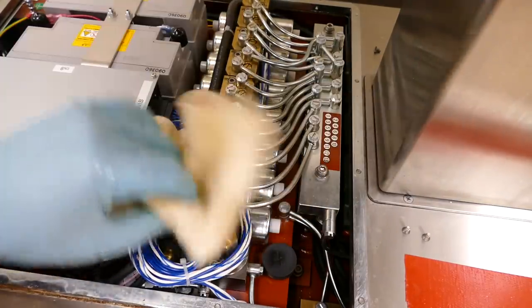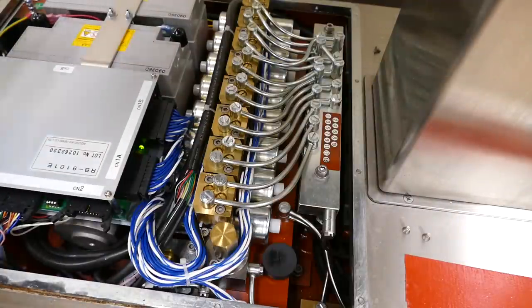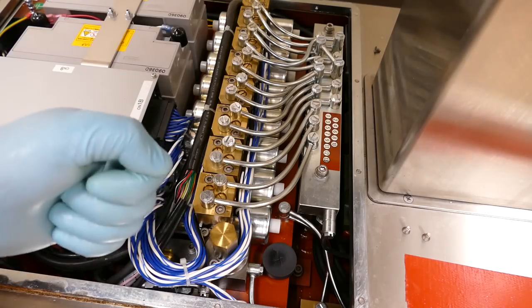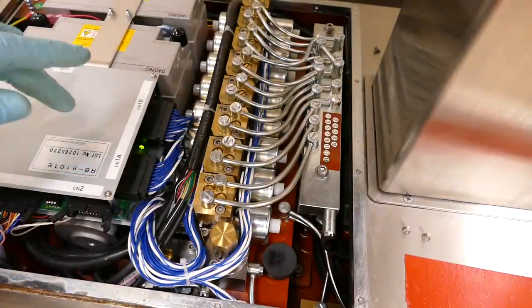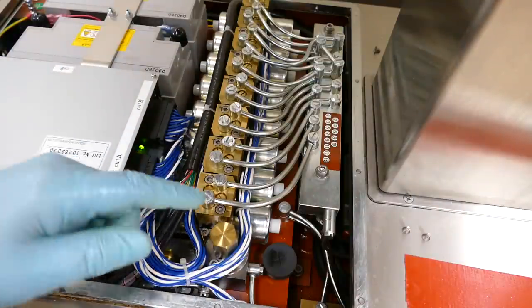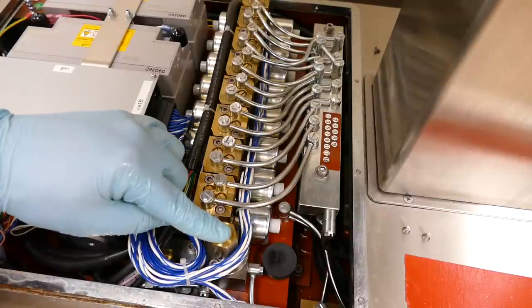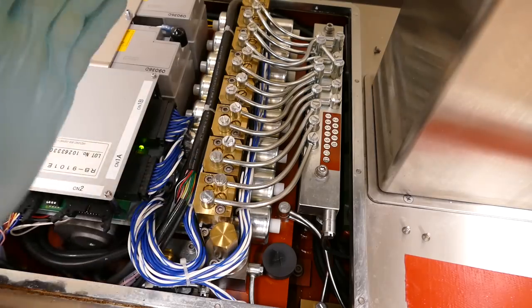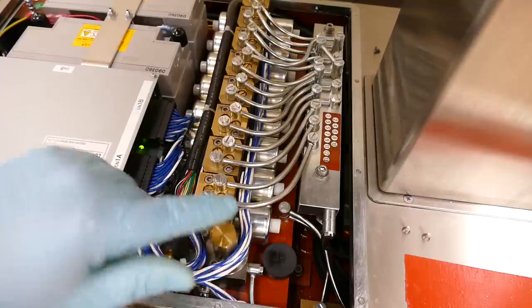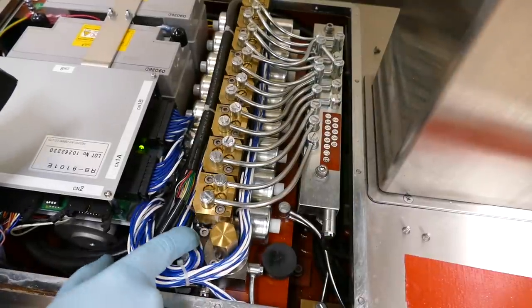Clean up the excess hydraulic oil. Now we're going to bleed out the air system by running it all the way to the end of its movement, let it sit there for a moment, then run it all the way to the other end and let it sit with the hydraulic pump running. When it reaches the end of its movement, this right here diverts the excess over-pressure back into the reservoir. Underneath this cap is a screw you can tension down to adjust the overall pressure at the termination of movement — don't touch it if you don't have to. Now we're going to test it, sliding all the way from one side to the other, looking for leaks around these fittings and between the blocks.